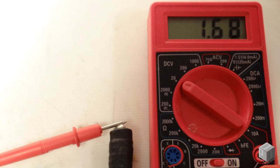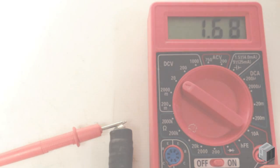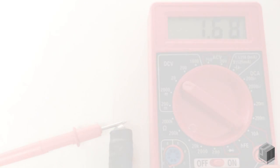For troubleshooting, it is normal for your voltage to be high at first and then level out. If your voltage is slightly low, try pulling the battery gently from the ends to stretch it slightly. If your voltage is very low, you may have a short. Electrolyte square may be misaligned, or you may have stacked the components in the wrong order.